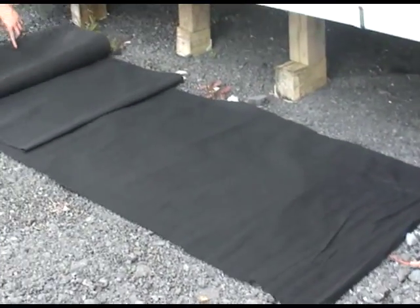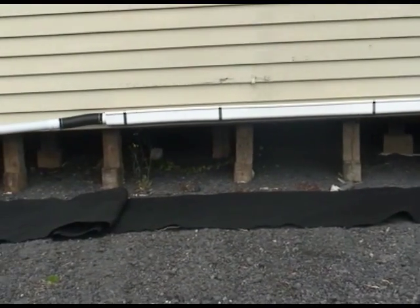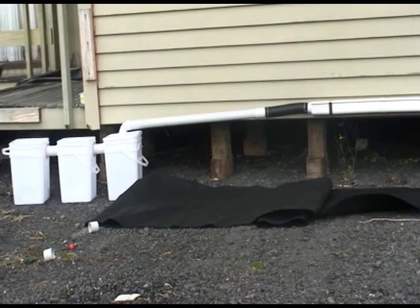When you need to reposition the guttering, scoop out the waste from the gutter into a container for disposal. Remove the riser in tank three to drain it. Then disconnect tank one and fit the cap over the inlet into tank two. Gently pour the water from tank one into tank two, disposing of the waste slurry in it.